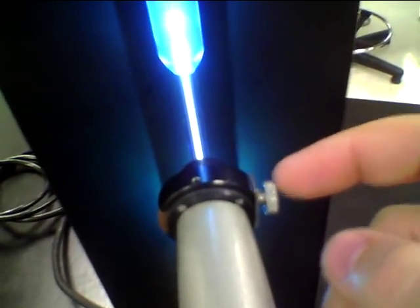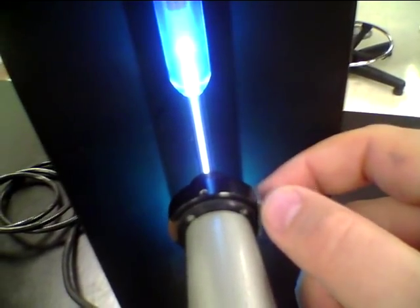Now there are a couple of adjustments we need to make for calibration. If the lines appear really wide — they should be really thin like that green one there — then we're going to adjust the slit right here, just a slight adjustment to make it more narrow.